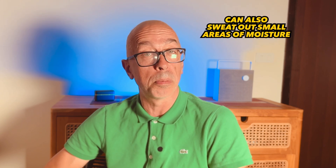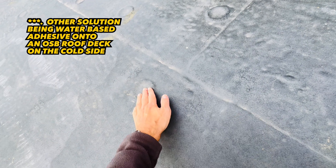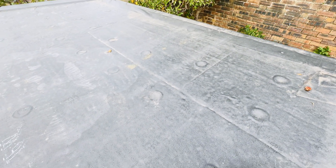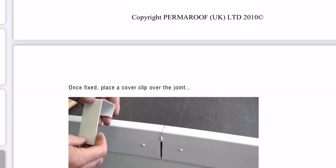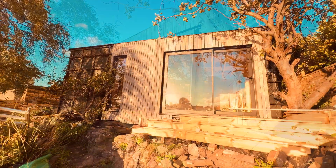Insulation between the joists hard up to the deck is a pretty horrible solution. The wonderful thing about EPDM is its ability to slowly breathe out any trapped bubbles of air — for novices like us, that's very important, because unlike the other solution it's harder to get the rubber down without any discrepancies. Now that we've glued our roof down, we can focus on edge design: fascias, soffits, gutters, and cladding. There are a load of plastic ones you can use, or you can minimize all of that and use the rubber to create your edges for that minimal, clean look.